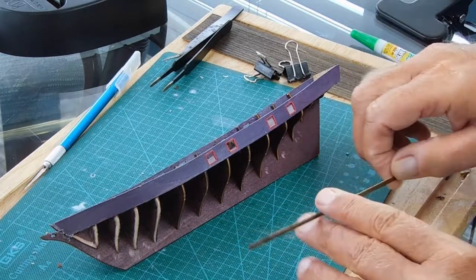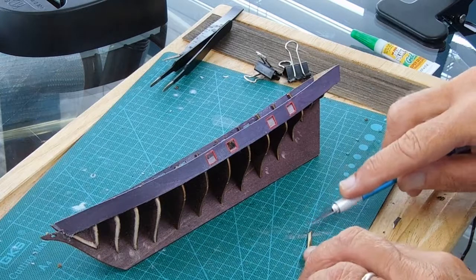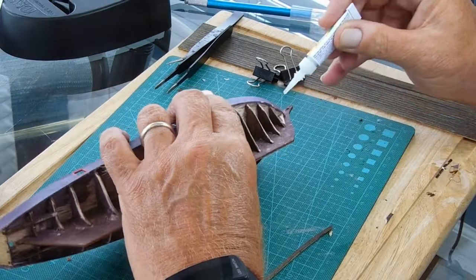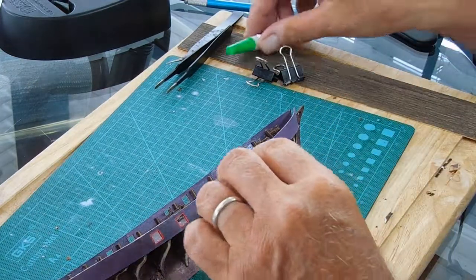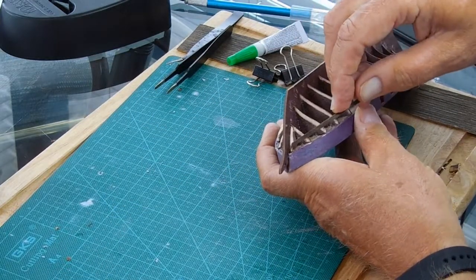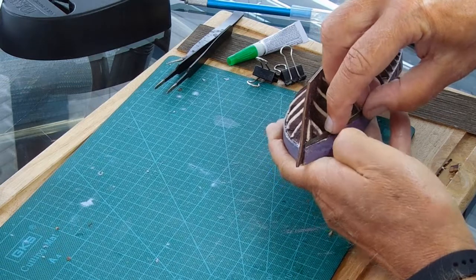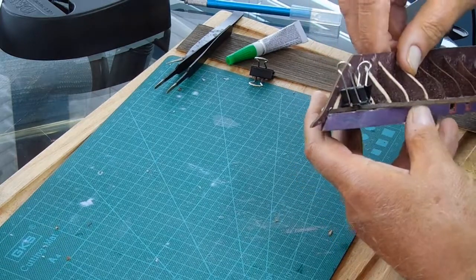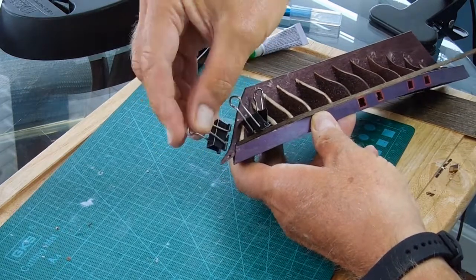I've steamed some of my planks. I already cut this one off. All I do is I guesstimate the angle that I would want, and I just slice it at an angle more than I wanted. So I just want to get it started. Try and get it lined up the best that I can. And then I'm pretty good at putting these little clips on here — put one there, one on the very edge, to kind of hold this in place.